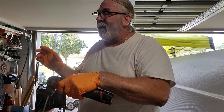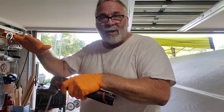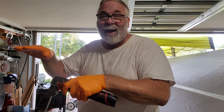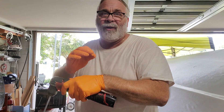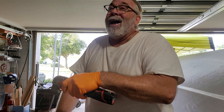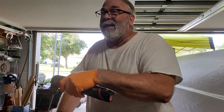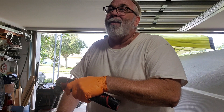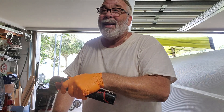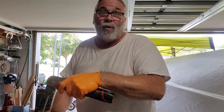Right now, if you've noticed on the other side or from the other videos, there were little air bubbles. That's okay because I sanded them out — they're gone and it's flat. But it left little craters, perfect for the next top layer of fiberglass. I think it gives it more to hold on to. And it's not like they're gigantic air bubbles and craters — but if this was not going to be primed and painted, I certainly wouldn't want those air bubbles showing in my epoxy.